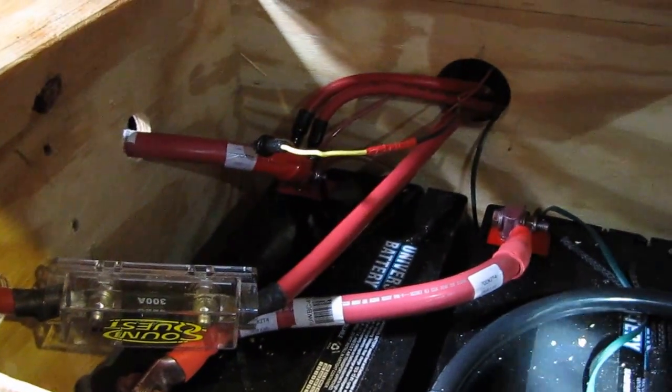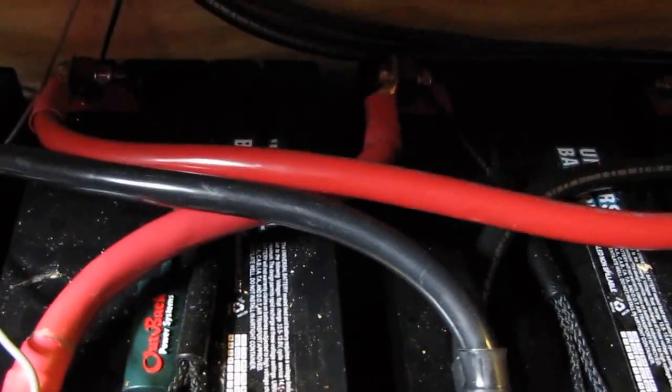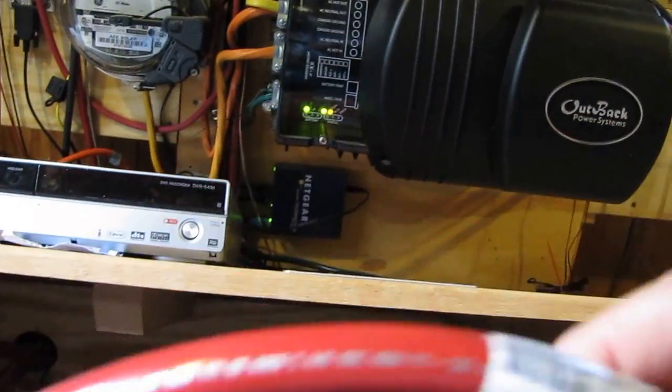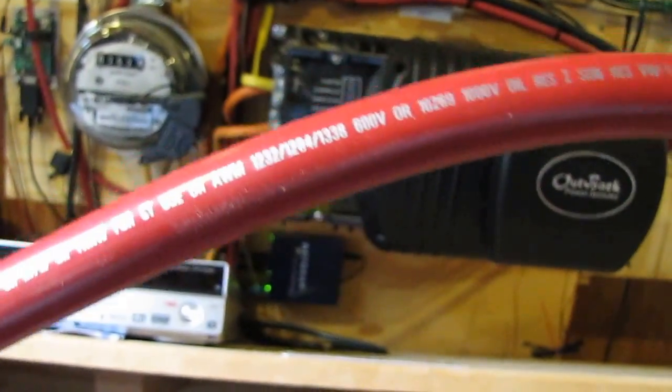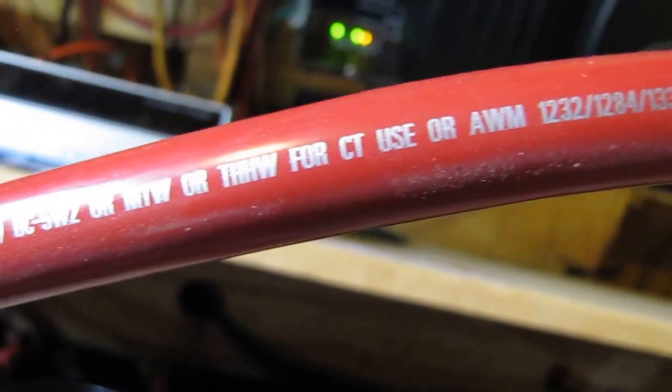It's working great — super great! We're getting some wind today. It's a super hot, humid day; the heat index is terrible out here, but that's how I got my battery bank. I got my batteries spaced apart with an even gap all the way down. For the parallel hookup, these cables are 2-aught, 24-inch — it's a 24-volt battery bank — and the other ones are 4-aught going from 12-volt to 12-volt.